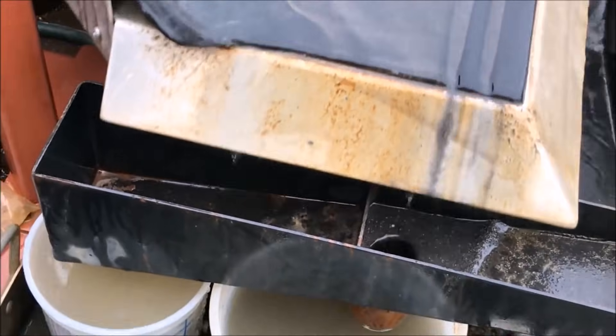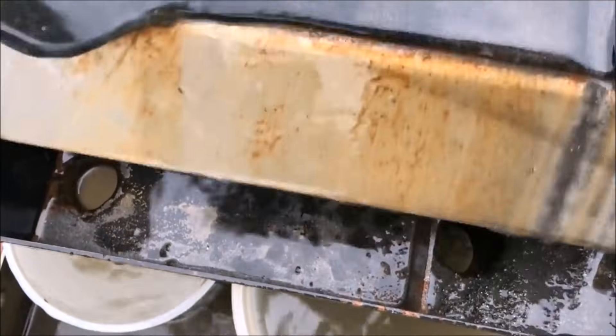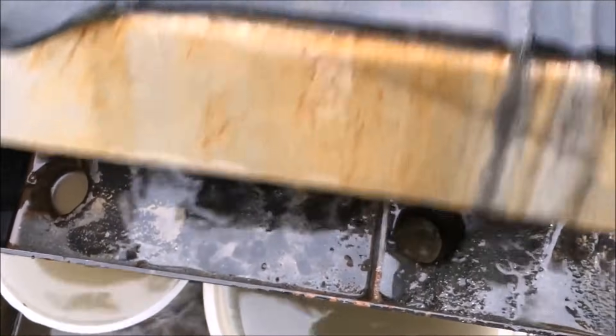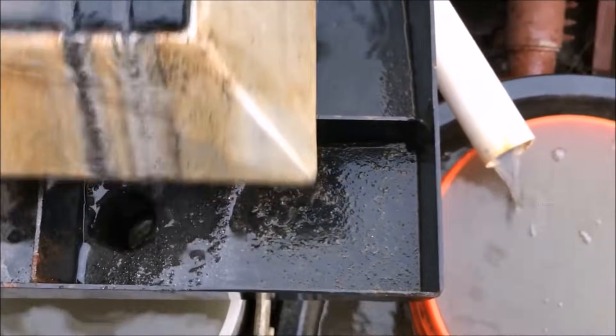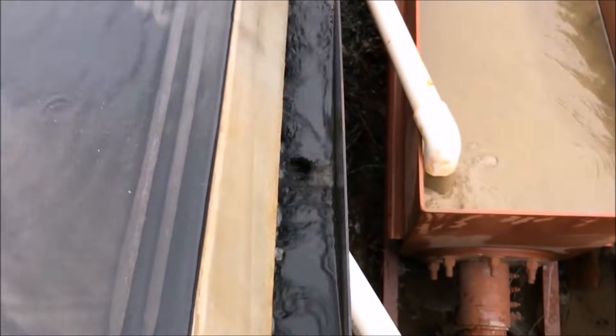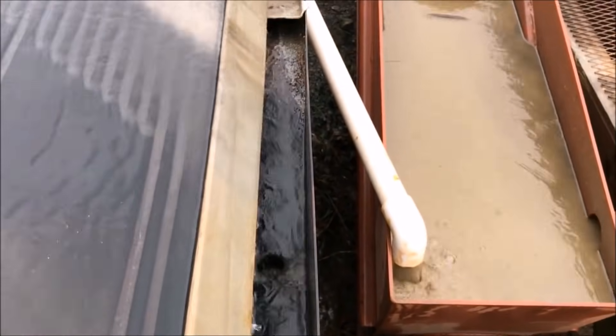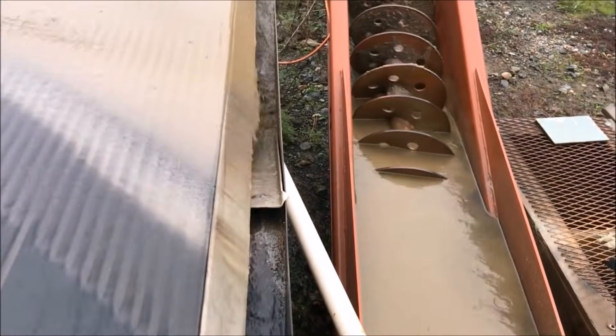The gold line works its way right down into the number one trough, and then there are two safety grooves coming across the table into the number two port — both those are high-grade ports. Working our way around the edge of the shaker table, you can see the number three middlings port, which is where your primary amount of sulfides is going to go. The splitter is tuned to capture a little bit of quartz, but most of the quartz is going into the number four tailing.